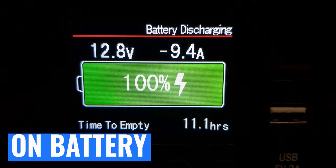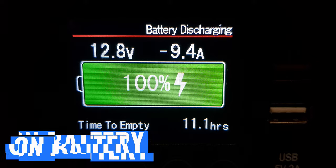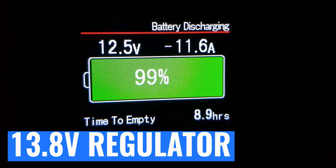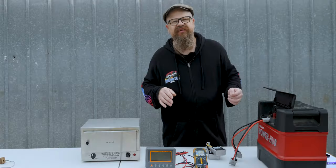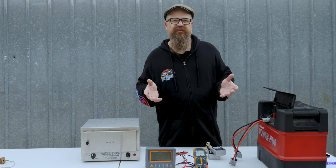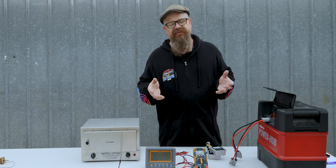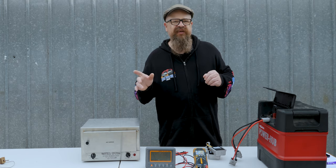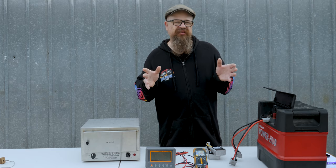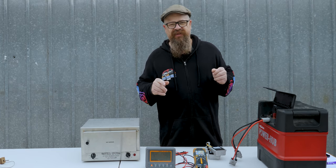When we're drawing just on battery it's 9.4 amps. When we step it up to 13.8 volts there's a substantial increase — it's now 11.6 amps. But when we plug in the 15-volt converter, with the same load coming from the oven, it's actually using 13.6 amps. So we're using a substantially greater amount of current, and that could be an issue — but wait, check out the end of the video because all isn't necessarily as it seems.